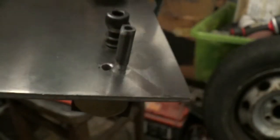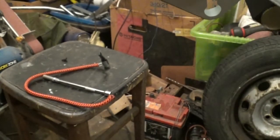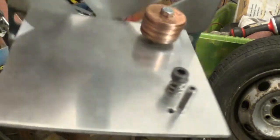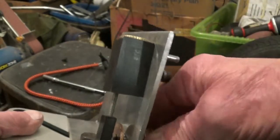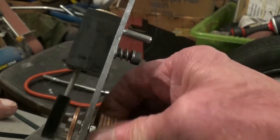So it's not that I've made a mess of drilling. The whole thing is notchy - it wants a flywheel twice as heavy. It's just not going to work, that's it. So like I said, if you've got nothing to do and you want to have a play, and you've got loads of stock and a good drill, by all means have a go. If you want to have a bit of fun and try and make something that looks something like - well, by all means have a go. But if you want to make a little working model steam engine, well, don't bother.